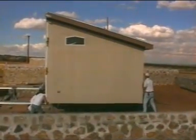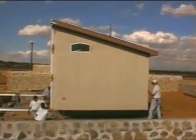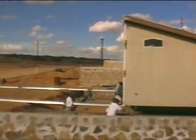The stand has a working range from 36 to 10 inches. For higher foundation walls, the stands may be cribbed up, or longer tubes may be ordered.